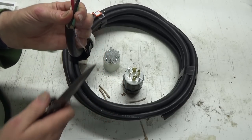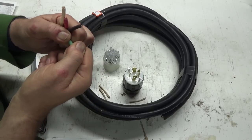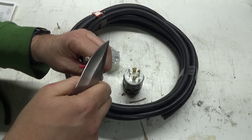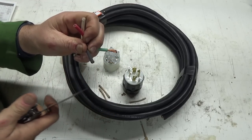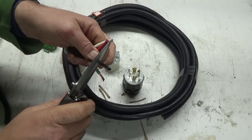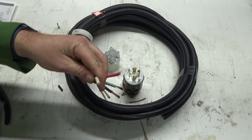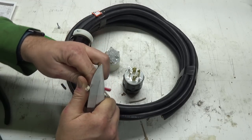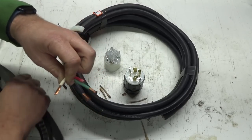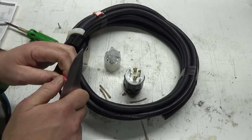Hopefully we've left enough here — that should be decent enough. There's a little bit extra. There's some fiber stuff in here — I don't know what it is. The rubber on the outside is pretty soft, mushy stuff and should come off pretty good. Got to watch this knife, I just sharpened it — it's very sharp. I'm just trying not to cut through my finger. There's our neutral. Leaving about an inch of bare wire here. And this is a 10-gauge, four-wire cord.